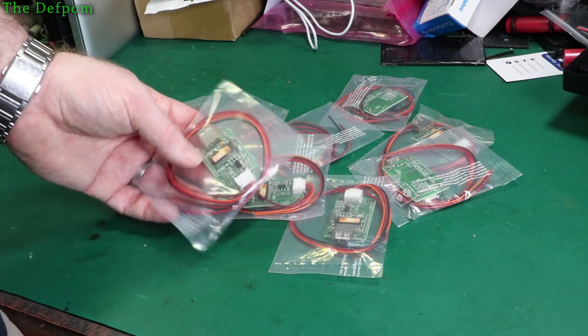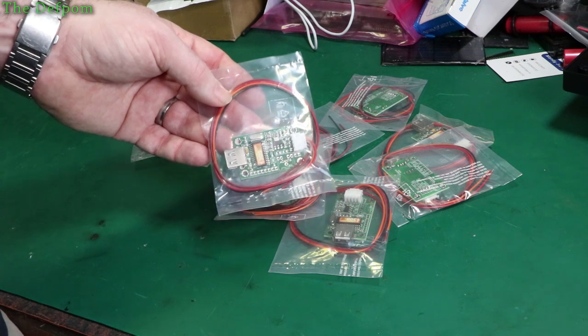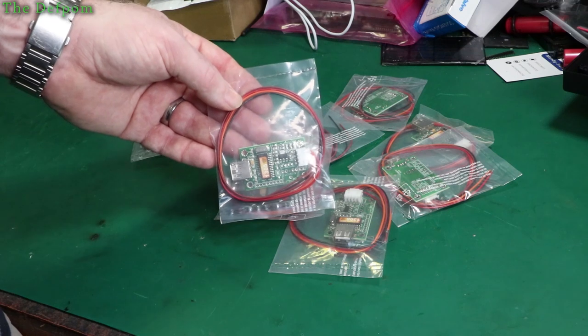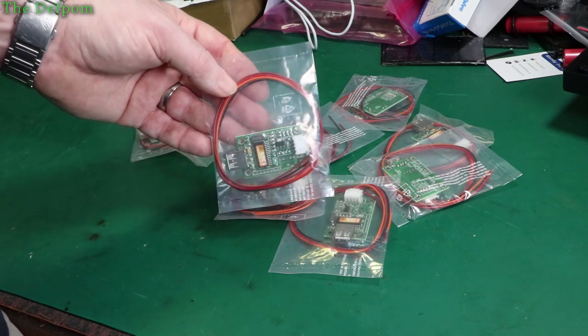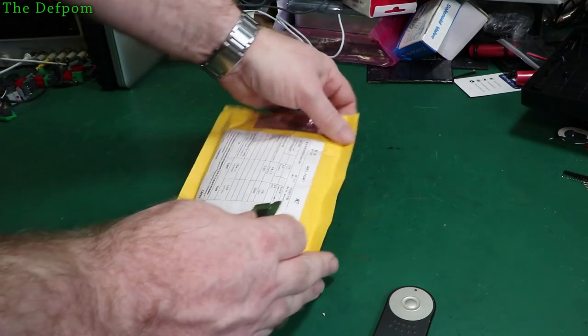It doesn't actually do every key. Some keys like the escape key will give you a different value, for example. You have to watch out for that. The generic keys are fine, but things like function keys do different functions and won't output a key code for those. Escape key and arrow keys are others — I don't know what the proper ASCII or decimal values are for those particular keys. But as long as you know what values to look for and what they use in your code, it's fine. It works. I've used one of these successfully and it's been really good. It tells you if it can work with a key or not — it has an error LED on there. This one cannot work with a keyboard which has a USB hub built into it, so only a plain keyboard. If it's got a hub, it won't work. There will be links down below for these items as well.